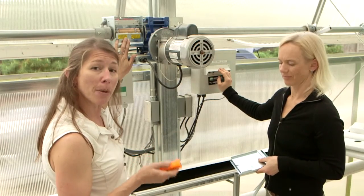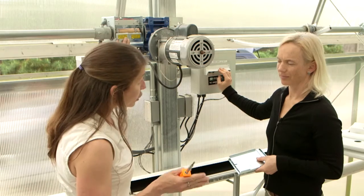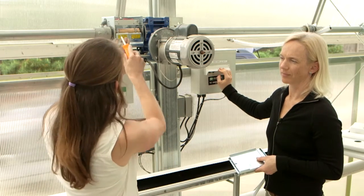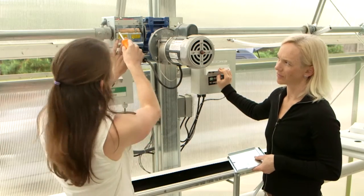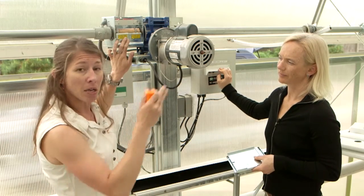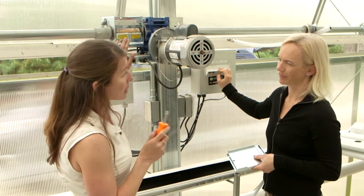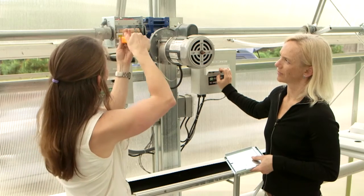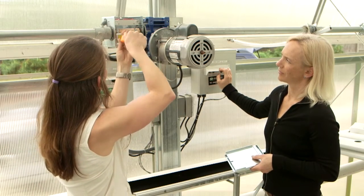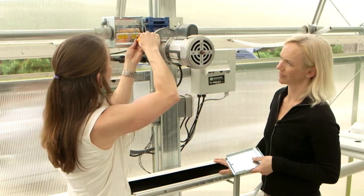If we wanted to move it either a little bit further open or a little bit further closed for more or less ventilation, I normally make a mark with a sharpie or a pen to note my starting point. That way, if I'm moving this internal limit a few teeth forward or a few teeth back, it's very easy to get back to that starting point. Once done, we need to make sure the screws are tight on the keeper plates on both sides — for the open limit and the closed limit.